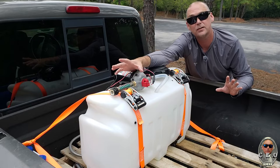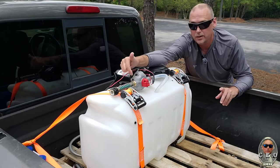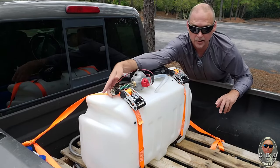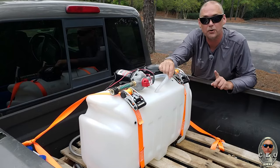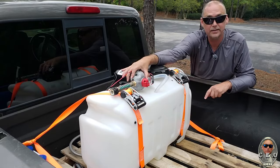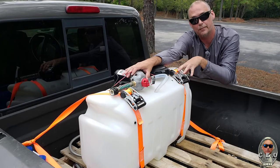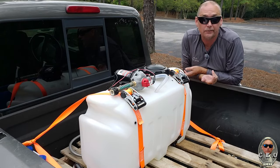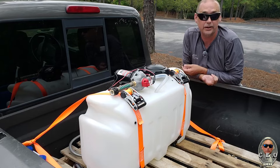A good tip for you: being a man means learning to adapt, and adapters are great at that. So we're using an adapter here and here and here and here, out to here, out to a hose, quick connect onto a garden hose. I have 200 feet of garden hose that I connect to this that I can walk around the house and treat the house with sodium hypochlorite. Usually I'll let it dwell five to ten minutes before I start rinsing it off with water so that it doesn't damage the house or anything like that.